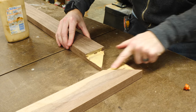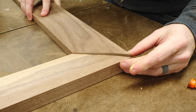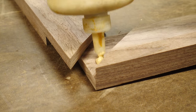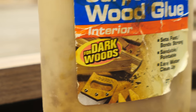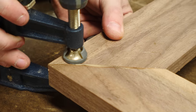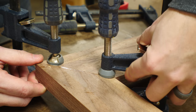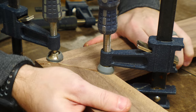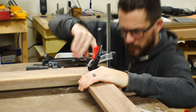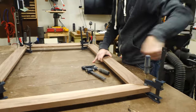Gluing up these corners was really straightforward, but I did make sure to put glue on both the horizontal and the vertical surfaces before clamping it up. This makes sure that everything will be really nice and tight. I also used dark wood glue for this — it is a thing and I'll have a link below. A really good thing about using the half lap here is that you can just clamp these pieces straight together top to bottom and don't have to worry about any crazy clamping techniques.